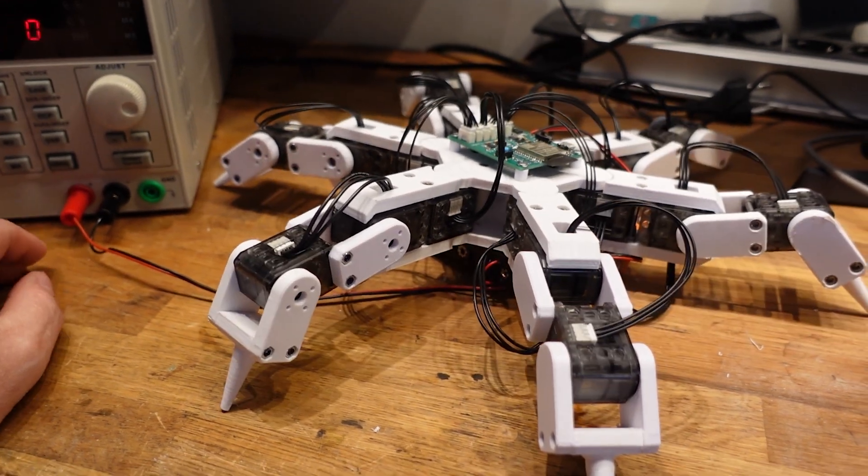And put it to sleep. As you can see, it's not exactly perfect — it's a bit choppy. Today was the first time I could actually make it move, so I'm quite happy with that. The simulator concept seems to be working. But I'm thinking maybe I should send a bit more complex commands to the robot — send it the set of angles it should cycle through for one step, and then let the controller just cycle through those commands until I send it a new command. That should make it a bit less choppy. You could see that it paused for maybe a fraction of a second from time to time, and everything is now running at constant speed.